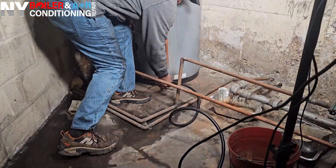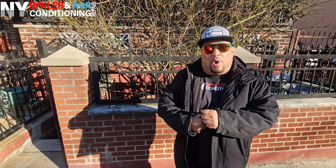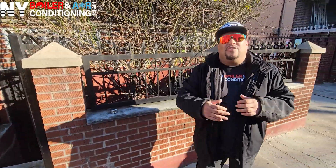The next step after that is — you have to drain and remove the water from the tank. You got to get a long hose, go to the nearest drain, and make sure you connect to the drain valve — you don't want to make a mess of water. Most importantly, we have to pump and drain out the water and remove it physically from the tank because when you remove a tank that's full of water, you can imagine how heavy it is.